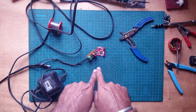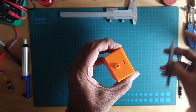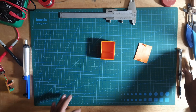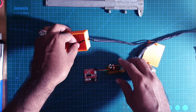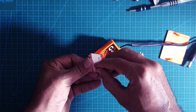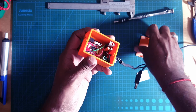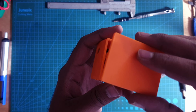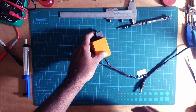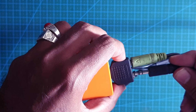Now let's build an enclosure. The 3D printed enclosure is here with a snap-in connector — push it in to open the lid. Let's pass the power supply wire through this end and fasten it to the terminal block. I've pasted double-sided tape onto the Bluetooth board to fix it nicely inside the enclosure. The components are assembled, so let's close the lid. Since our Bluetooth speaker has two 3.5mm jack inputs, I'm using a splitter to split the output from the Bluetooth receiver board and connect both jacks.